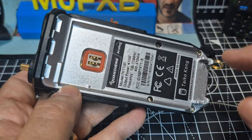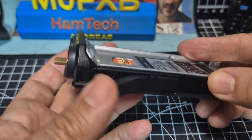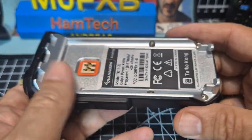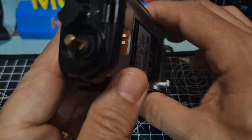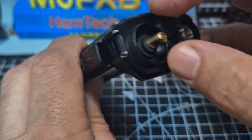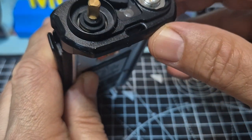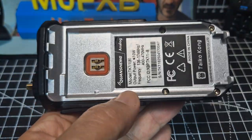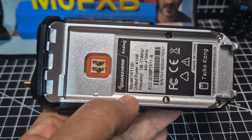So now we're going to undo one, two, three, four screws and it should just pull up. Obviously you've got to be careful because the sides are going to have some plastic bits inside. I can't find anything under there, so I'm just going to undo those four and then carefully see if I can pull it up and keep an eye out. There is like a rubber grommet there but it looks like it's just going to come away. I just want to have a close-up on the circuit board and see what chips are there.